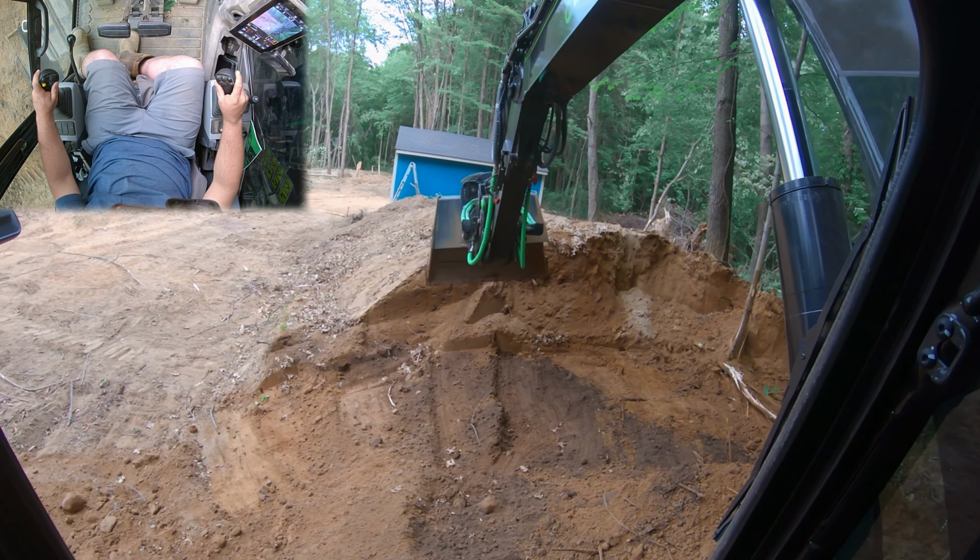Again, we're going to start with one more because obviously this is a septic field, so we can't really allow any more cover on it, and we don't want to bury any of those covers like I successfully did. So you're going to slowly just start rotating these rocker switches, and you're going to use your bucket as a curl to gauge that angle, using that rocker switch and rotating that bucket uphill. Now we're slowly pulling a bucket uphill with a grade. Look at that. 3/4 of a bucket, we'll call that. That's not into the septic field.